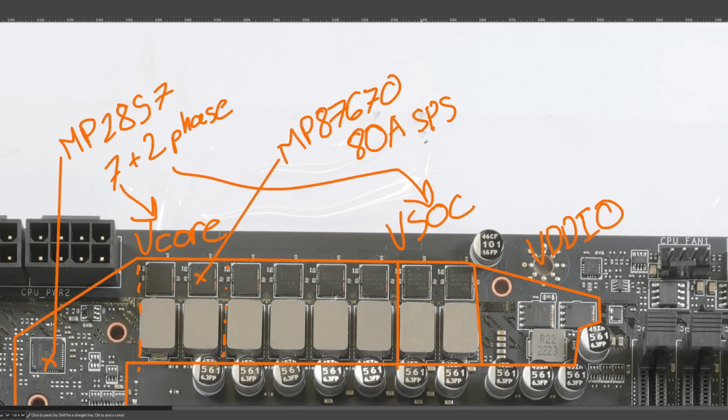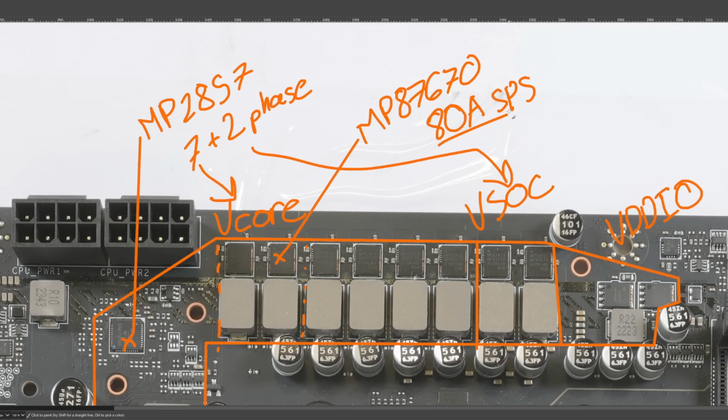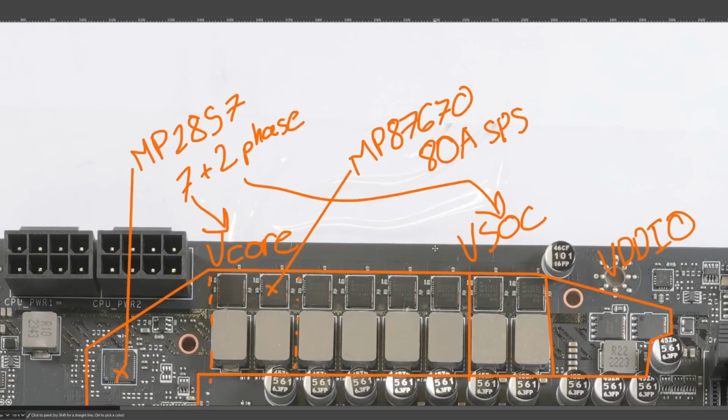Basically the way I like to think about it is if the nominal current rating is higher than 70 amps, it's good enough. Because everything above 70 amps, there are some parts that are better, but a lot of them are kind of the same. So 80 amps, 90 amps, 100 amps, without actually testing them in a very controlled environment, because obviously if the motherboard has different VRM heatsinks, then less efficient parts with more heatsink are going to run cooler. More efficient parts with worse heatsinks are potentially going to run hotter. So that doesn't really tell you how good the actual underlying power stages are. It tells you how the combination of all of the parts of the PCB, the heatsink, the inductors, how all of those combined perform, which doesn't necessarily require that the 110 amp parts actually are more efficient. I mean, these are 80s.